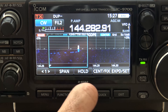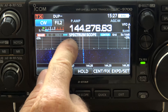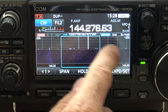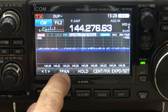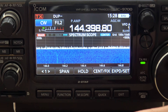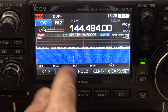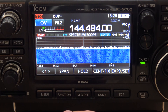And it gets better — you can also tap on the screen and touch right where the signal is. Now if I go on the bottom here to Span: the span is 25 kHz above the center and 25 below — that's a 50 kHz slice. Watch what happens if I span it up to 100, 200, 500, or even 1,000 kHz. That's roughly 144 to 145 MHz — I get the entire 1,000 kHz slice and I can see what's happening in different places. With doing that, I'm taking in more signal and you can see the noise came up. In certain situations it may make it harder to find that weak signal.